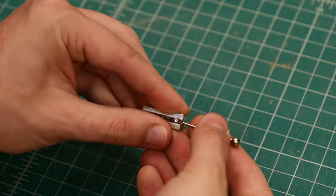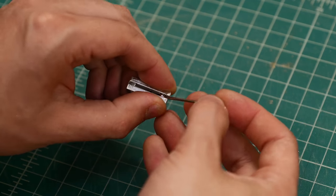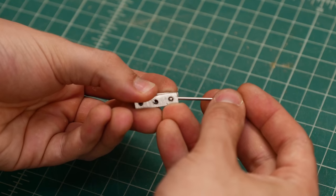Conclusion time for the first experiments. I've learned a lot about aluminum — it is softer than I expected, coming from someone who's really never worked with any metal whatsoever. Aluminum is very soft, which is great for drilling and shaping, but it also means you can over-drill something really easily. For the first test, I countersunk that hole way too much, so the ball just completely sinks into the joint and doesn't have much room to maneuver.